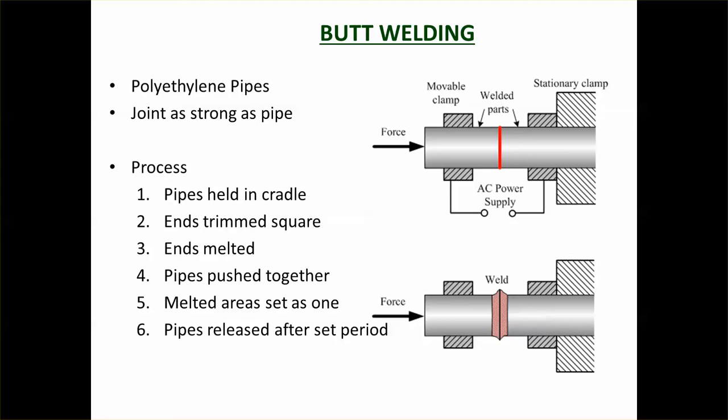The way you connect polyethylene pipe is by melting it. With butt welding, you weld both ends, then force them together in a welding machine, and keep it there for a while. The connected, melted area sets and forms a joint between them. In fact, there is no evidence of a joint after the melting is completed — it is as if it was one pipeline. You can't see a joint line at all. The joint usually ends up being the strongest part of the pipe because it's thicker.